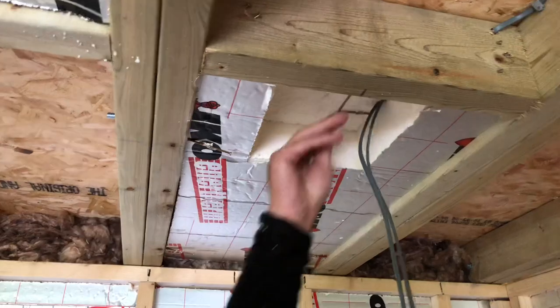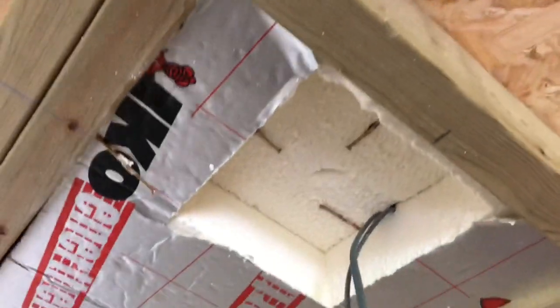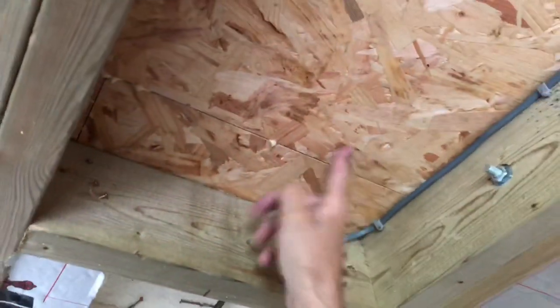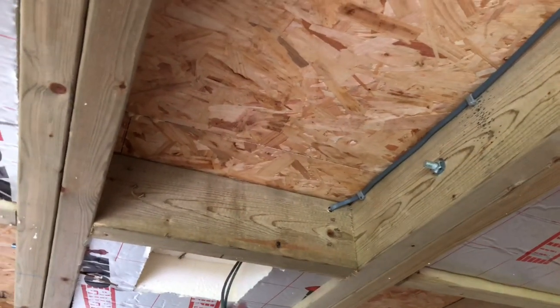Can you see that, Adam? So I've put four nails in there and that will hold the insulation up. Now, the idea behind the cold roof is that if you had insulation down there with an air gap, when that air meets the cold surface it will condensate — unless it's vented, but obviously we can't do that here.